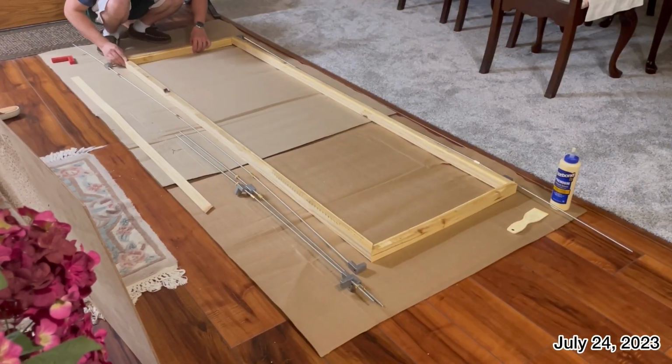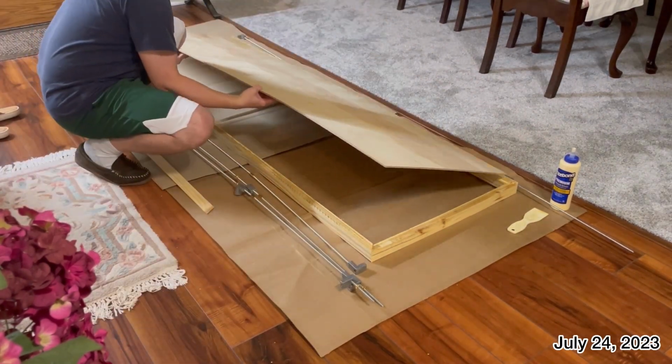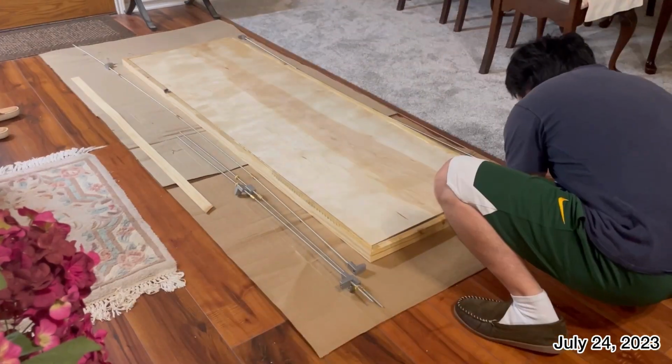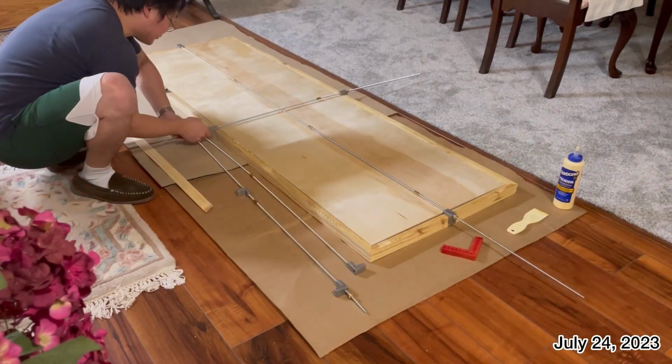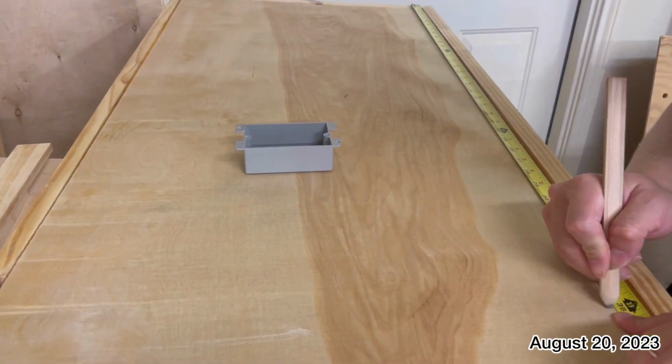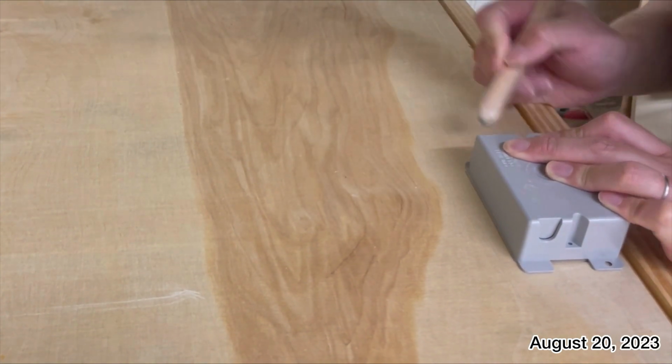I glued them together using wood glue and secured them with this picture frame miter clamp made by Wood River. The nice thing about this clamp is that it's made from standard parts you can get from a hardware store, making it very extensible. For one of the panels, I want to add a wall outlet, and for another, I want to add a light switch.